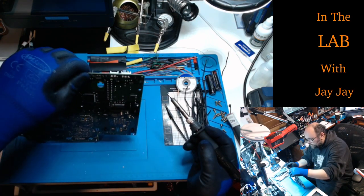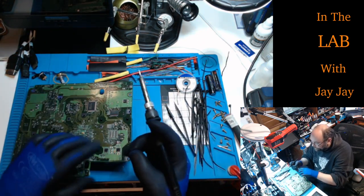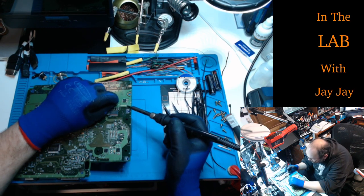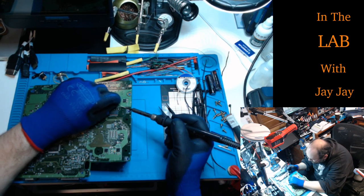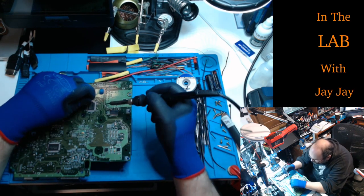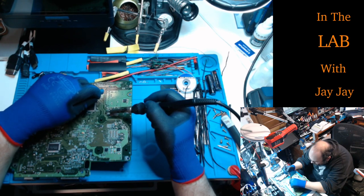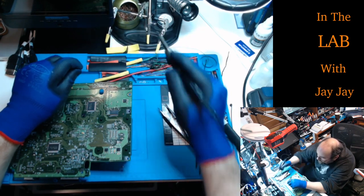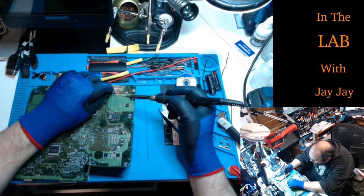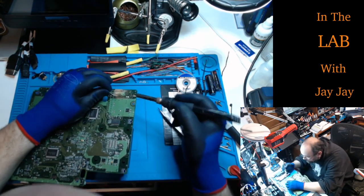Anyway, so what I'm going to do, just going to put some solder on these caps so I can pull them out better. Let's reflow. So, let's see. Let's put some fresh leaded solder onto the caps, and then we'll try our suction pump gun thingo again. Now, I don't have any experience with these suction pumps. I have seen other people use them, but my one arrived this morning. I've never used it before, so I might be doing it all wrong. If I am, feel free to tell me.